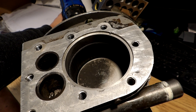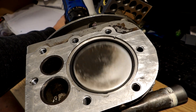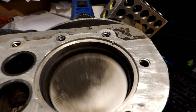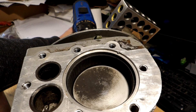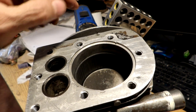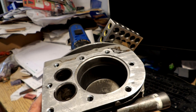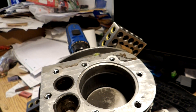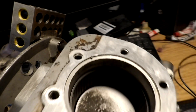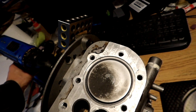The piston's coming back up again — that's the operation. I have to cut port holes in the block up at the top for exhaust, and down at the bottom through the sleeve and the block for the intake, then build an intake manifold around the block at the appropriate height. This is the first time I've driven the whole thing. The sleeve is a 3D plastic printed sleeve.